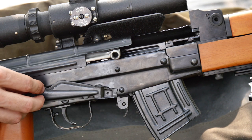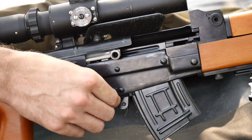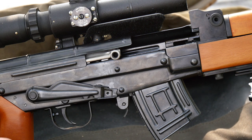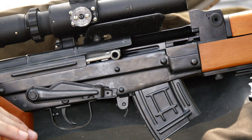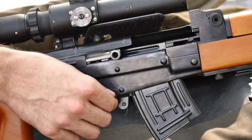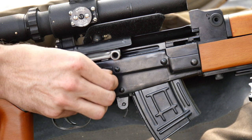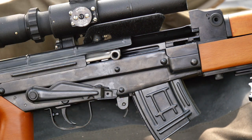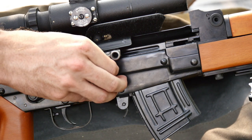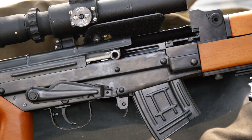If you purchase this and use it without the 3Bar D Productions side rail, you'd only have one level of position retention — the basic form that all other Type 81 safeties have. That is, two milled flats on the toggle cam that interact with the flat safety plate inside the receiver. In theory it could still work, but you won't have any over-travel stops. You'll be solely relying on the tension the paddle enacts against the receiver and those two flats cut into the toggle.